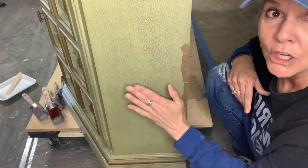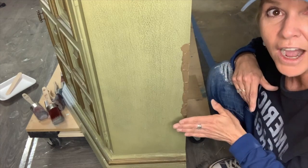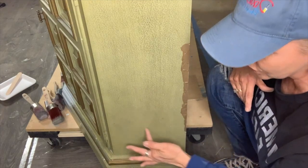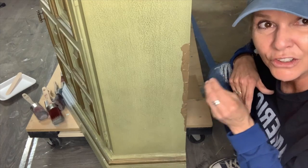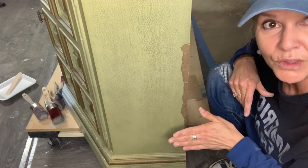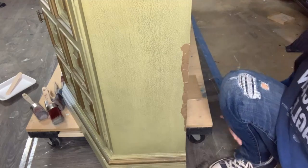I have an even plain field, so when I put paint over it, my paint is going to act the same over the mud as it does over the furniture — that satin clear coat seals it off so I don't have a porous area. Use the mud to fix your veneers, fill hardware holes, deep gouges or scratches. Let it dry completely — if you sand too soon, it'll pull out. Leave it overnight, come back the next day, sand it, remove the dust, seal it with a little coat of satin just right where you had the mud, let that dry, then start painting over it. That is how I fix any damages.